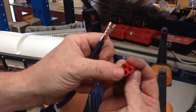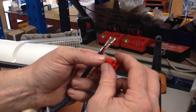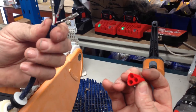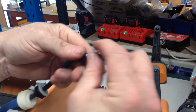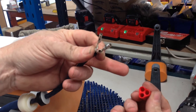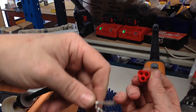You'll notice on the plug we have an inset side and a flush side. The flush side goes into the motor, so I'm going to hold that in my right hand with the key guttering at the top. In this case, the wire combinations are: top left black, top right white, bottom centre is red.